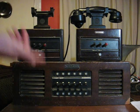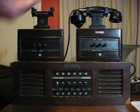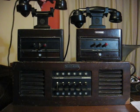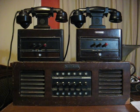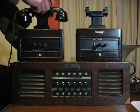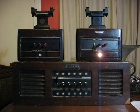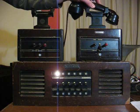If a substation wants to phone the master, he just pushes his key down, the light comes up in the master station's panel, and then the master can push the key down and they can have their conversation. It's also quite good in that the master has priority over any conversation. For example, if one substation is talking to a colleague, and the master wants to talk to that person, he calls them, and the substation gets a light on it so he knows the master station's waiting. He can then push the key down, they have the conversation, and then hang up.